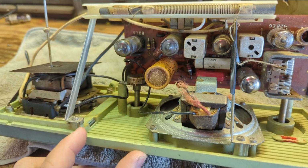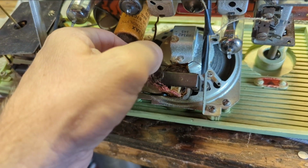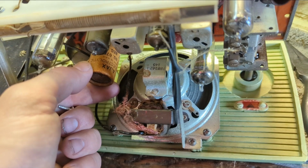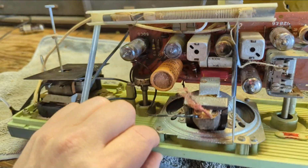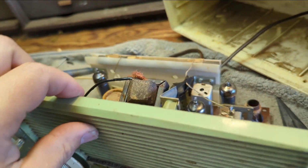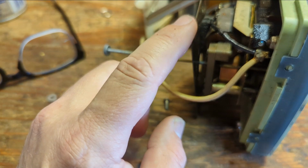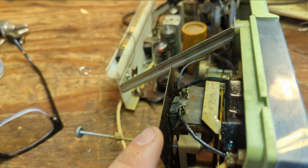The tubes felt warm to the touch. We've got this nasty frayed wiring going to that output transformer. Ajax electrolytic capacitor. It's probably bad. Let me see if I can get the alarm to stop wailing away. Maybe it just needs a little bit of WD-40 or something to loosen it up. Alright, well, this is weird. This plate is vibrating. That rotor is probably seizing up.